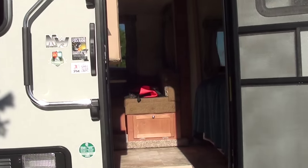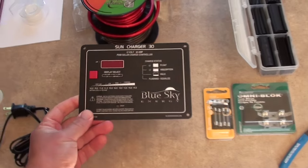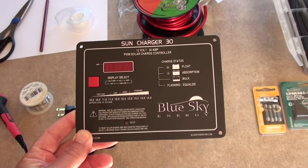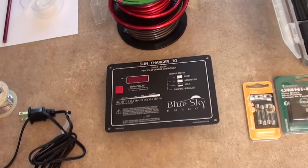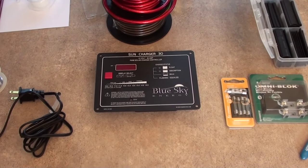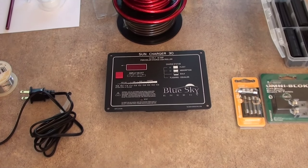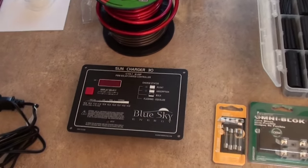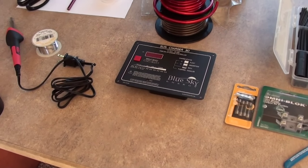This applies to a lot of Northwood products. I have got a Blue Sky 30 amp PWM charge controller, which is a very good PWM controller. It has the ability to set charge points, which is very good. I have got two Trojan 6V T105s so I can set the proper charge points. The charge controller that comes with this trailer is only 7 amp and is not going to do the job for the amount of wattage of panels I am going to be putting on the roof.